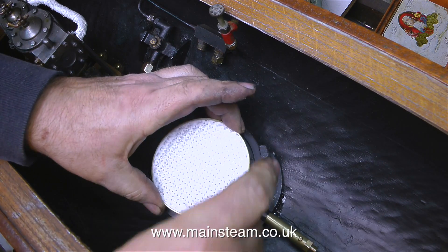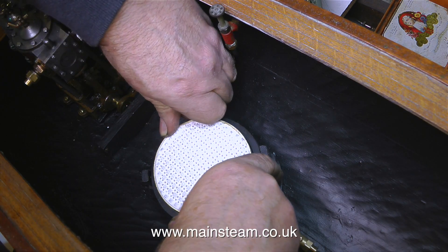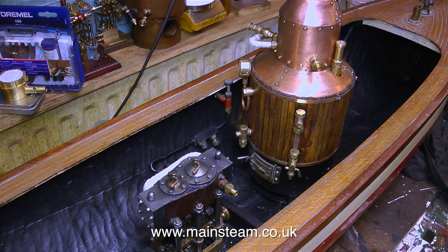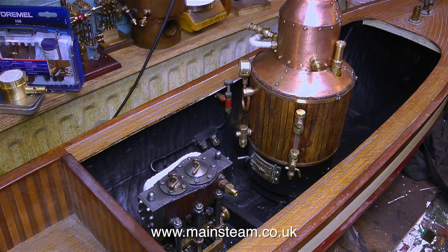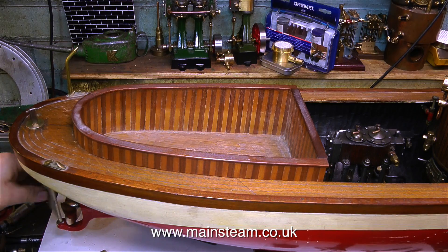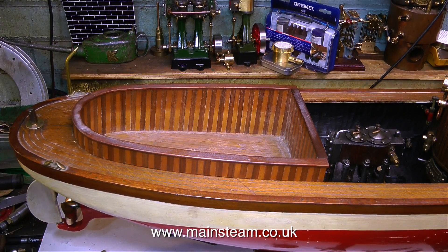If you look carefully at the ceramic — although it's bleaching the camera out a little bit because it's very white — you will notice that I've sealed around the edges, so it's quite a neat replaceable unit. With the engine and boiler including the water pump all in position, I can now pipe them together. I have to fit a displacement lubricator and a regulator and not forgetting the exhaust condenser — I need to make a special condenser for this boat. The boat is also going to need a lot of ballast, particularly at the front. I'm temporarily fitting the stern superstructure so I can have a look and see how much room is inside the boat — not much. But the good news is the rudder is very free moving. That's it for now, thanks for watching, and I hope you found it useful.